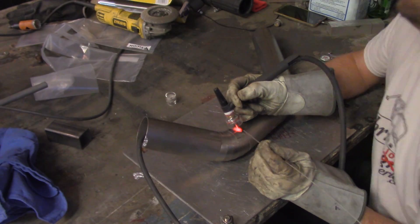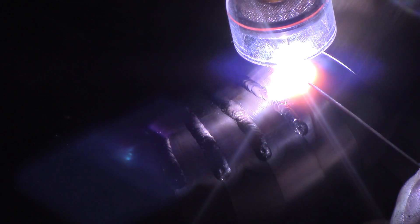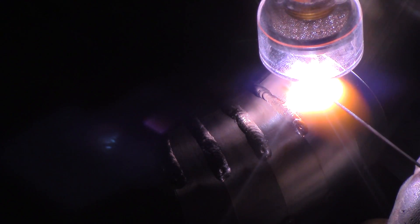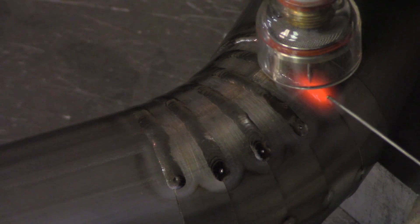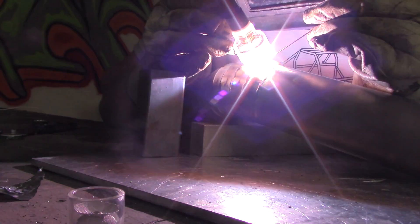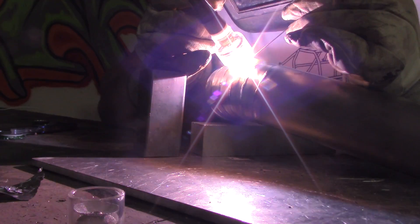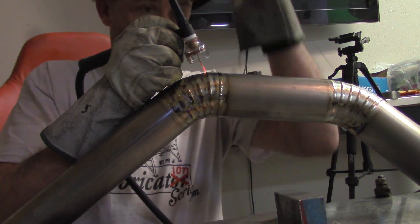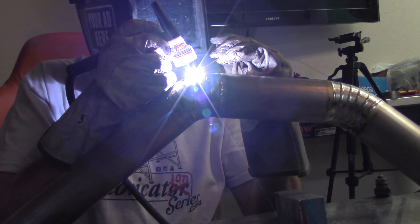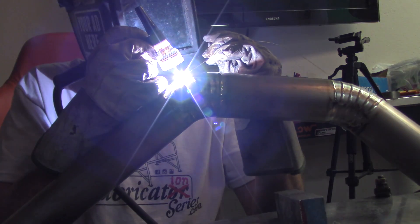Titanium is a little bit tricky and does take some practice to work with. Here's an idea of what it looks like in real time — I usually run about 10 dabs, which is roughly an inch or so, and then I stop and let it cool down. Nice and clean — minimize the amount of color, and then we'll just move on down the line. When it comes to welding pie cuts, you want to make sure you get a lot of gas coverage, maintain a lot of consistency, and keep it nice and clean. Pretty much just weld until you get all the way around to the end — there's no real science to it.